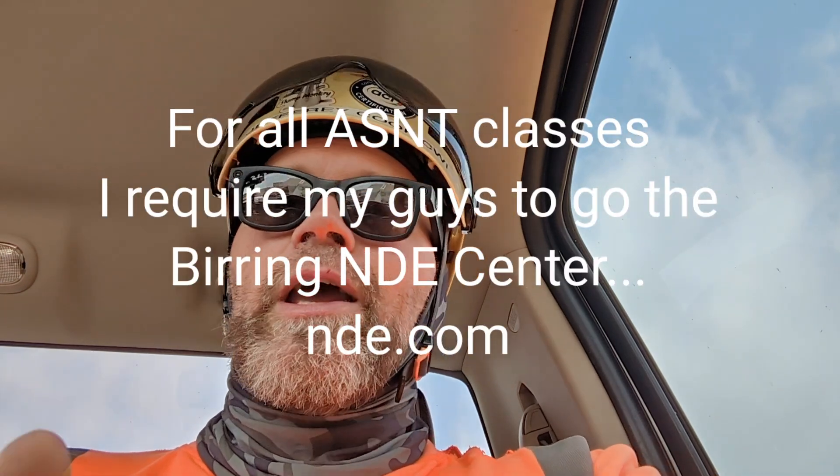Just being a CWI alone is great. But if you can also perform ultrasonic testing — UT levels 1 and 2, longitudinal versus shear — as well as MT (mag particle), PT (dye penetrant), RT (radiographic), and VT (visual testing), plus eddy current and phased array, there are a lot of different ways you can get those 80 CEs you'll need every nine years. And every nine years, you are going to have to spend some money.